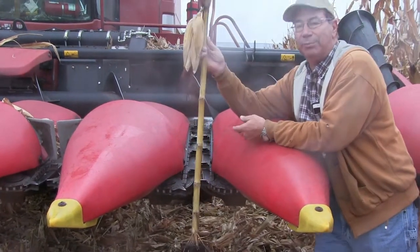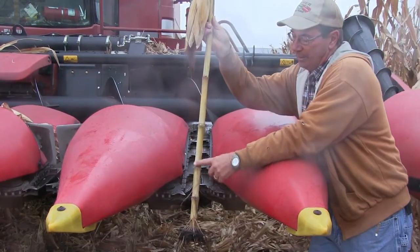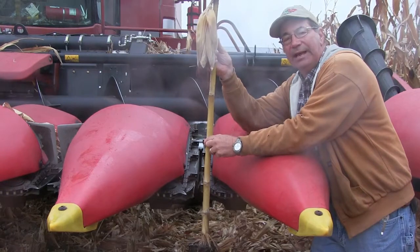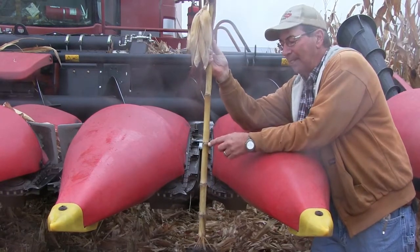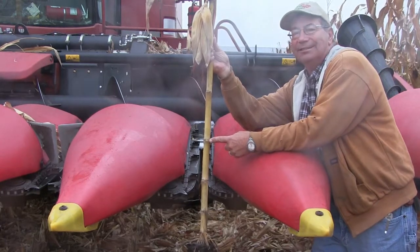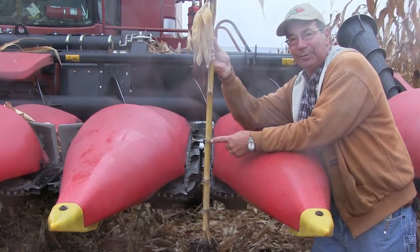To summarize, in my opinion we always come up to the third node. You can measure it there — it's oval in shape — and then measure the gap, but the third node has to be the determining factor that sets the gap of the stripper plate.